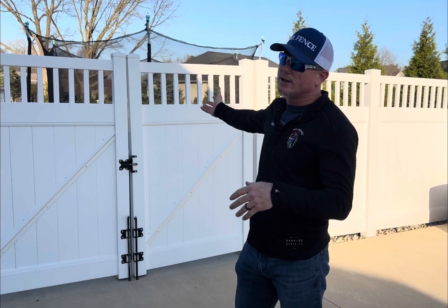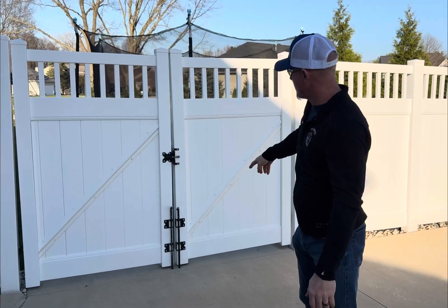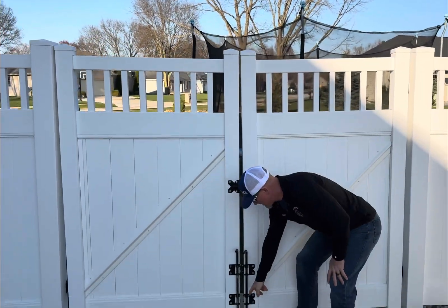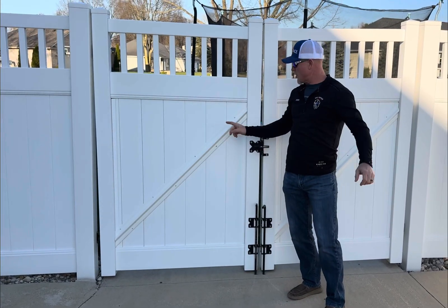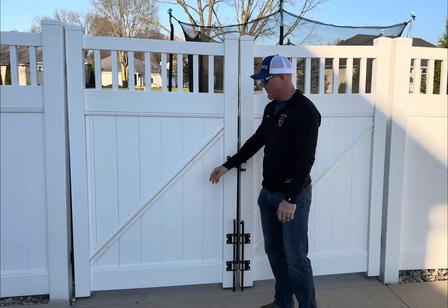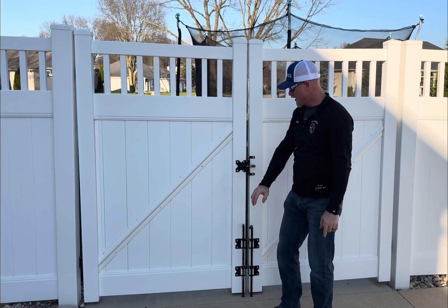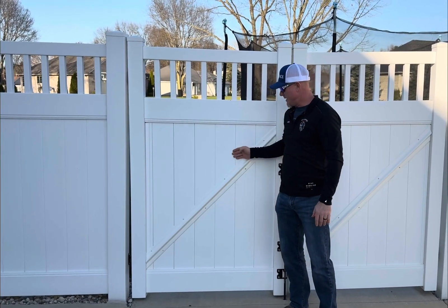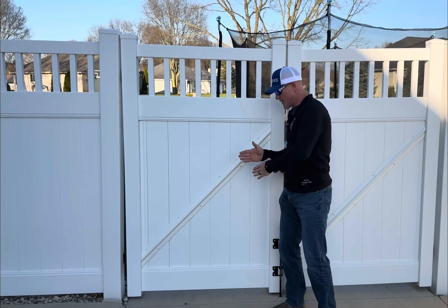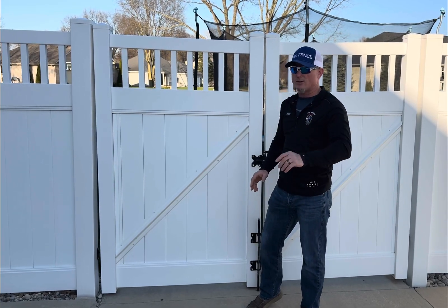In this case you can clearly see both gates are sagging, both gates have failed — they're both coming down, which causes a massive difference in the gap, and I'm sure it wasn't that way originally. This is a very flexible brace; it's a piece of vinyl you can almost fold in half and it won't break. It's in compression, so we're not getting much there. They do have it secured multiple times so there's very little flexing, however the pickets bow with it, so it's still not getting much strength or advantage.